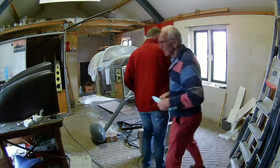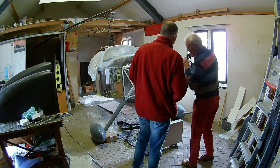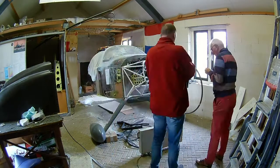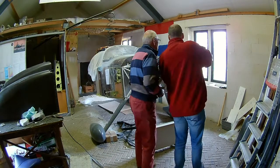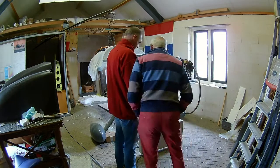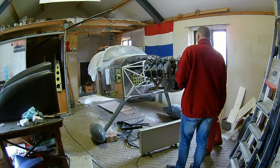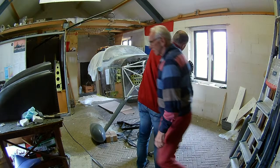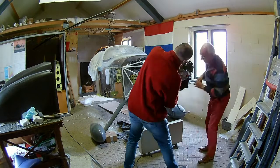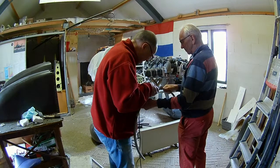We are looking at both the installation for the engine and the propeller. As you can see, we are mounting the bracket for the propeller and the control rod. There's not much space, but it works. We considered going over that rod — making a longer loop — but decided that is not the way to do it, as it would also be problematic for the upper cowl to fit. So here we create the last hose.